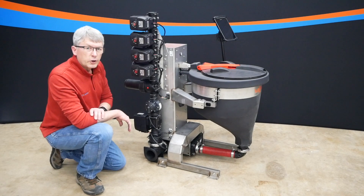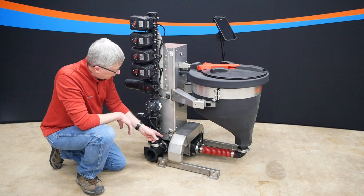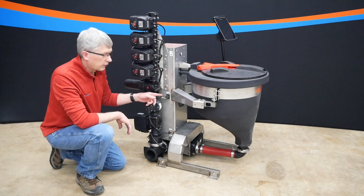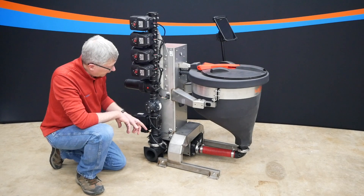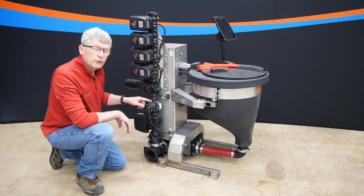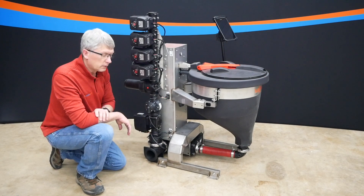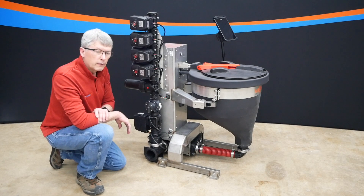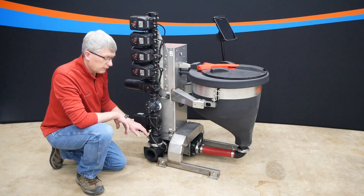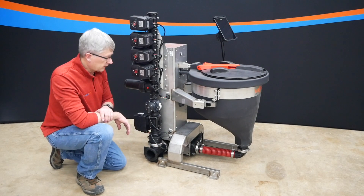I would like to show you the electrical connections on this side of the machine. We have three connectors here. The top one is for the valve stack — this controls the set of digital valves. We have flow meter 2 right here, which is typically used for the meter within the valve stack. We have a CAN bus connection for expansion of our system, and then this CAN bus cable for the valve plugs into a connector at the bottom of the system.